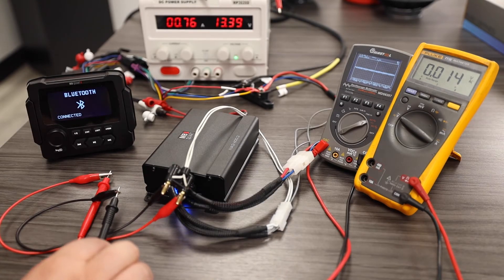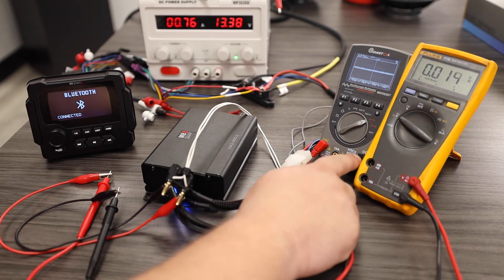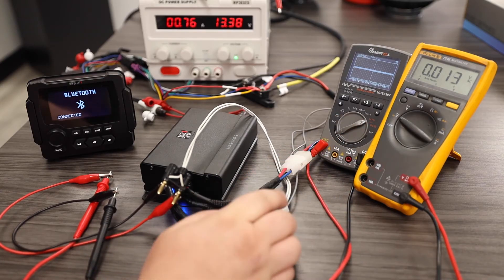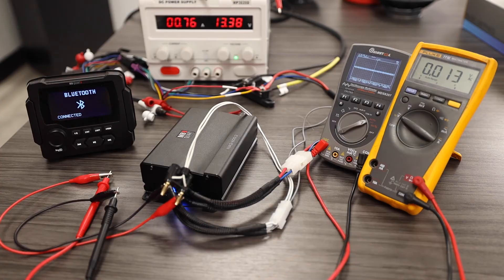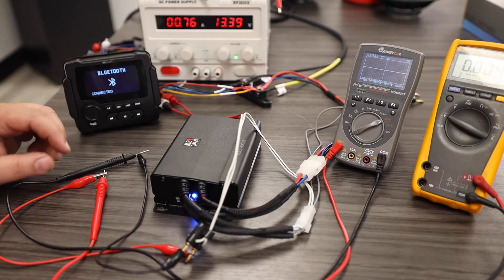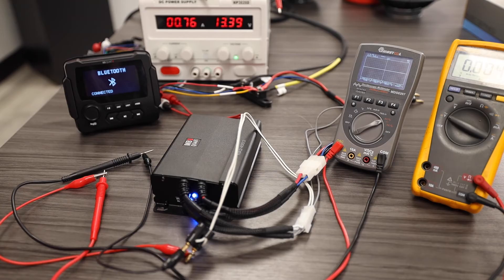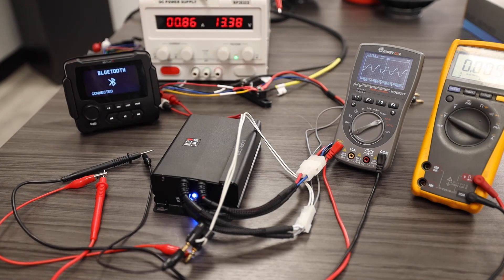On this particular oscilloscope I would have my probe set to oscilloscope in common and the AC oscilloscope range setting. Now that I have my alligators clipped to my oscilloscope rather than my digital multimeter, we are going to set our test tone to play. As you can see on my oscilloscope, we now have a sine wave playing.